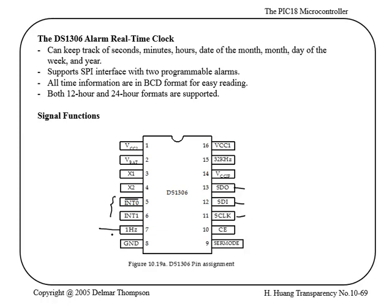If you have a circuit that needs your PIC to do some things at one hertz, you don't need to dedicate one of the timers on the PIC. You could simply tap into this one-hertz signal, maybe connect it to the INT0 pin on the PIC microcontroller, and then use that to do the one-hertz operations.